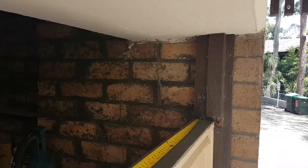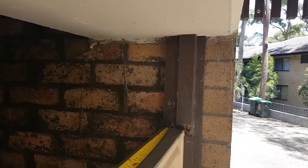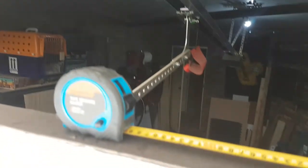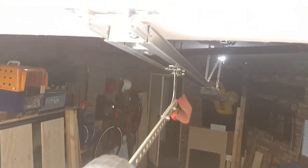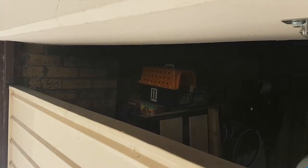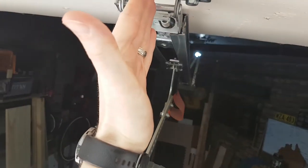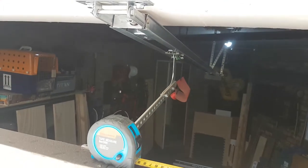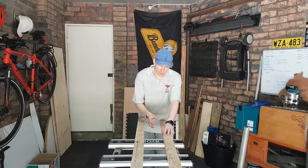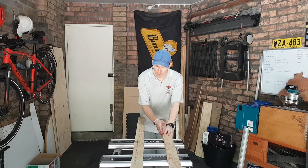Here are the important measurements: 27 centimeters - 270mm high. The really critical measurement, because I have the automatic garage door opener, is this length which comes out at 1.6 meters exactly. The frame is going to run here and there will be a second box frame on the other side, with just two pieces so the plywood can cover the mechanism but the frame itself will sit either side.